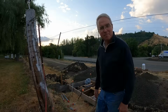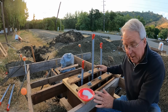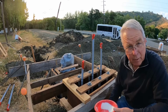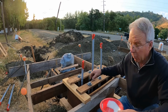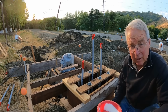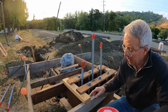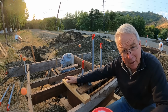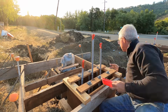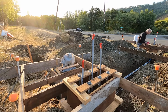that's a little fussy. So we're going to be dumping concrete right into this little opening right here, and it's going to cover everything. Now, I've already used good old-fashioned Crisco. This is what's left over to grease the top of the bolts and the inside of the forms and the chamfer strip. And I forgot until right now that I'm also going to fill the screw heads with Crisco, because they're going to be covered with concrete, and a Torx drive bit will not go into a Torx drive screw head that's full of concrete, but it will go right into the Crisco.